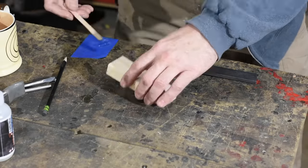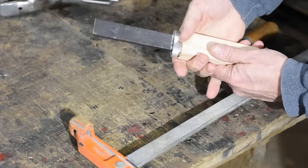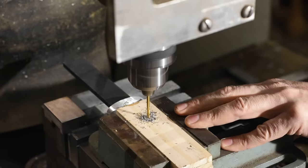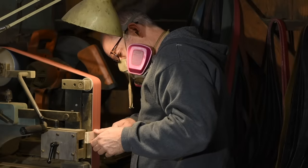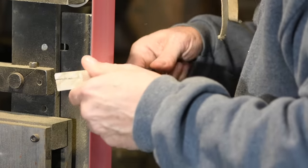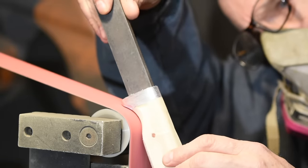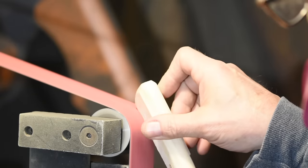Typically, you'll hold the whole thing together with a cross pin. Once you've got everything assembled, you can glue it up, or you can drill the hole for your cross pin and then glue and assemble the whole thing at one time — it's up to you. Personally, I like drilling the hole after it's glued up. You want to make sure that the joint between your guard and your handle material has been finished to whatever degree is necessary before assembly. Different guards and finishing techniques will give you different amounts of access to the contact wheels on your grinder, to files, to whatever tools you're using. If it's a guard that blends into the handle seamlessly, you may need to have everything near perfect before assembly. It really depends on the design.